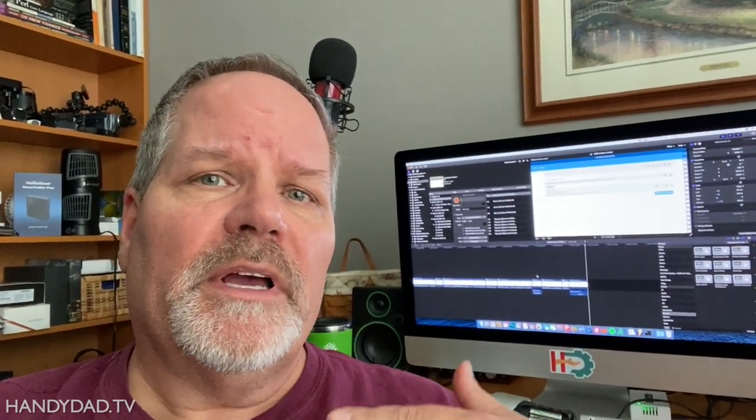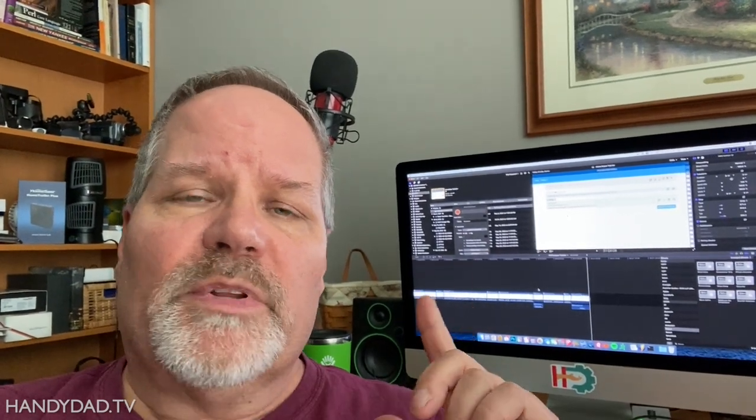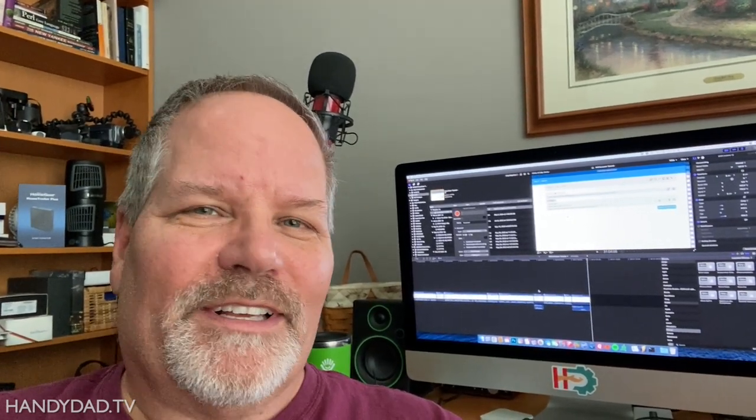I think this video has gone on long enough. Those are all the capabilities I use in the MNS Insteon plugin — there could be other capabilities I haven't even scratched the surface with. But these are the things I used in my testing, and this is exactly how I set up my HomeSeer server with this plugin to control my devices. I think it works great and it's an awesome, user-friendly solution. Go to the HomeSeer forum for the Insteon plugin — I'll put that link in the video description. Please give this video a thumbs up, and thanks for watching.